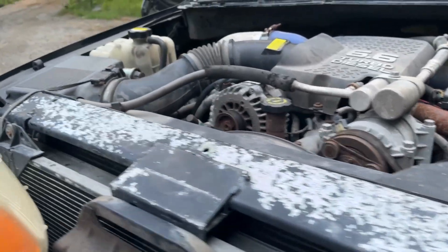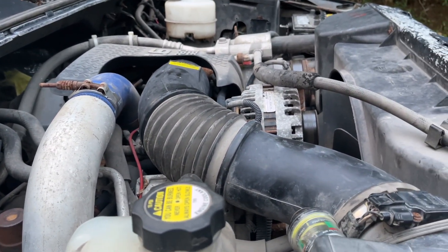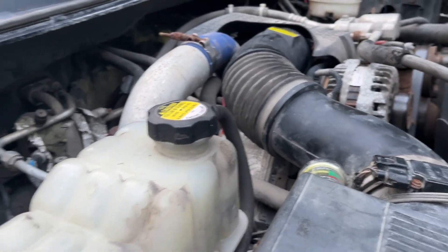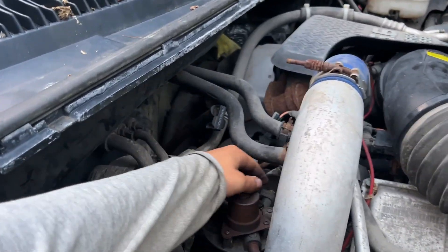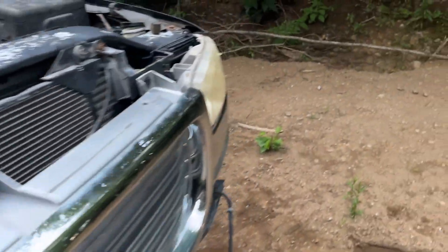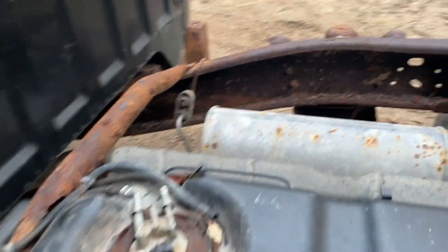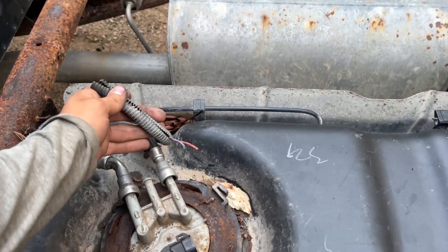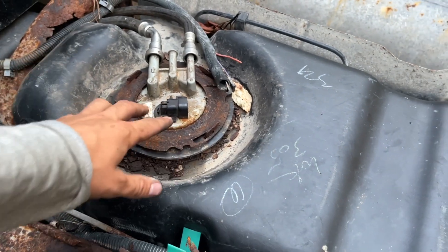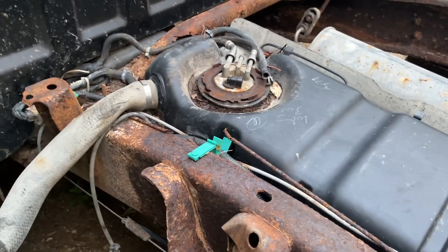It was running when I got it. I think it's actually out of diesel right now, and there's a possibility it needs a fuel pressure sensor or there's a bad wiring harness — pretty common on these. The fuel lines are soft and I'm fairly certain it's out of diesel. When they took the box, somebody snipped the fuel level wires going into this jack. Because it's a diesel there's no pump in the tank, so it's literally just those two wires — I should be able to put that jack on real easy.